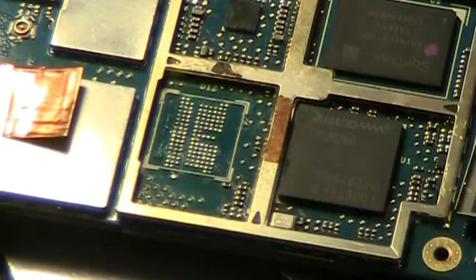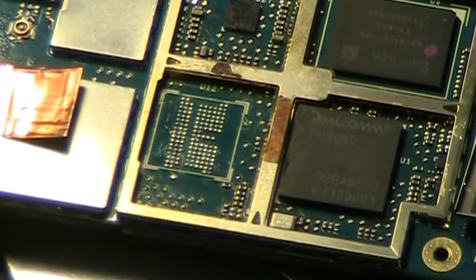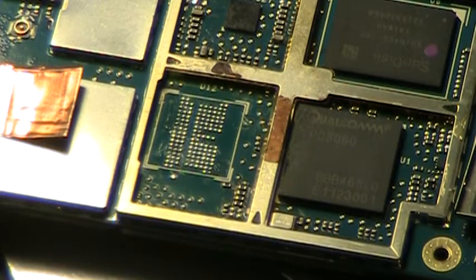So I just have to be sure when I use the hot air gun that I'm going over the whole thing very well. I didn't see any evidence of bridging — no solder that had melted and touched onto the next pad or anything like that. So that was good, because I was kind of convinced that must have been what happened.